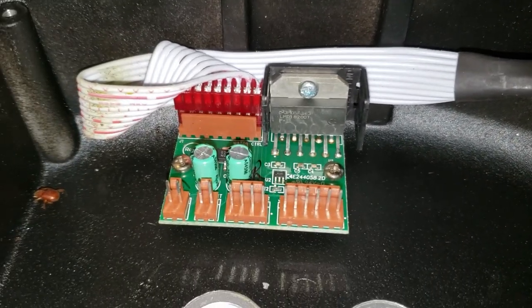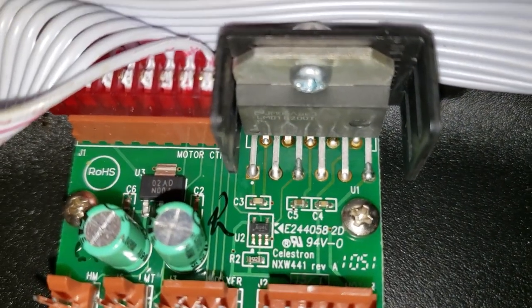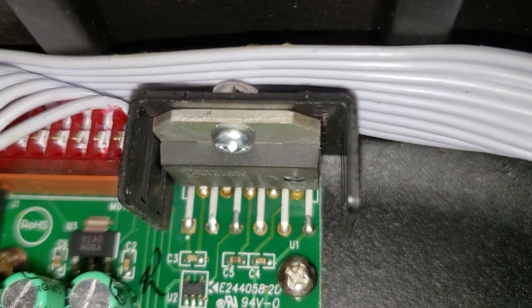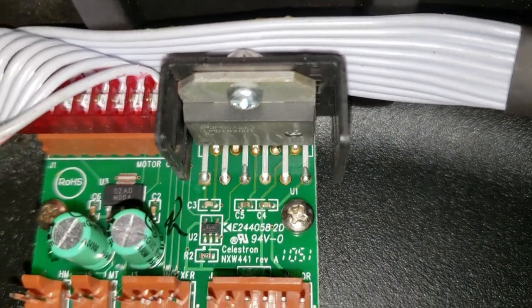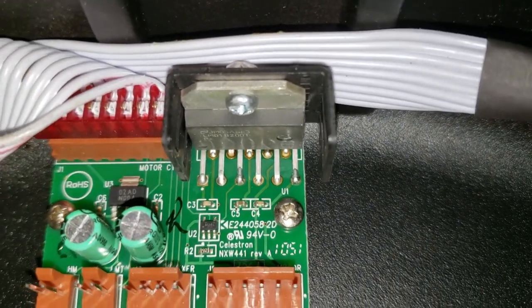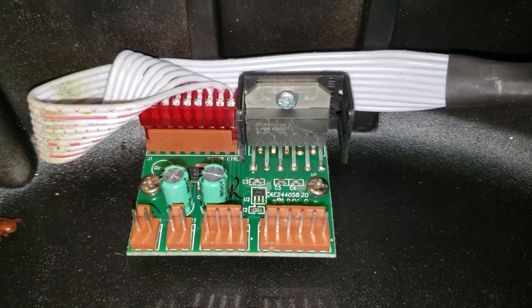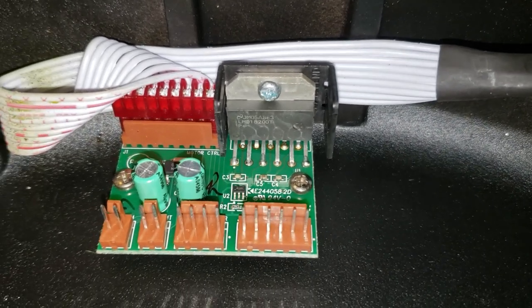It's that time of year. One thing that does disturb me — I'm going to pull this board and take a look underneath — I'm seeing far too much gold around those pins for the actual driver board. I'm wondering why there's not more solder visibly wicking up on the lead. It's possible this driver's actually not soldered in well. That'd be great if it was just a cold solder joint that I needed to re-solder.